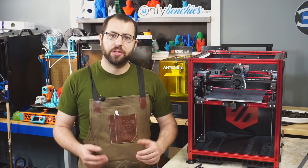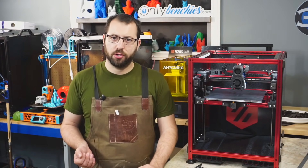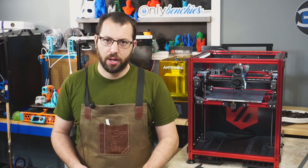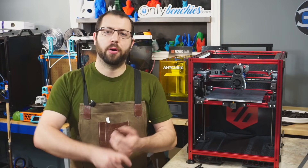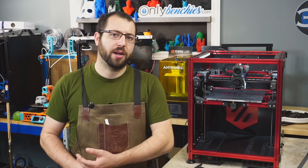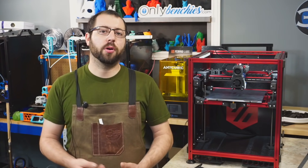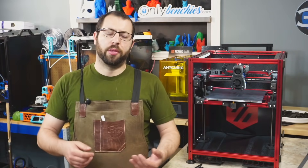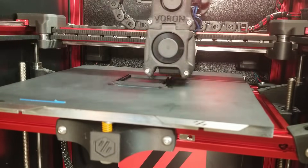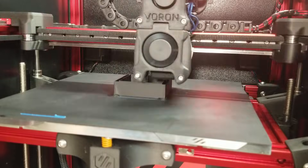Lastly, pressure advance — this is a very simple thing to tune. There are built-in macros in Klipper to do your pressure advance tune, and I do have another full video on my channel. Slice and print the test print from the Klipper GitHub with these settings: 100 millimeters per second, one to two walls, no infill, no top layer, dynamic acceleration control turned off, and a coarse layer height — on a 0.4mm nozzle, print at 0.3mm layer height. Run the command to set your velocity limit and the command that adjusts pressure advance as the print goes on — there are two different commands, one for Bowden and one for direct drive.